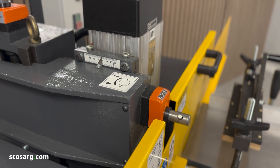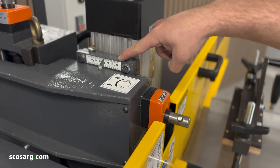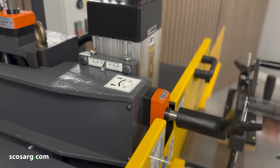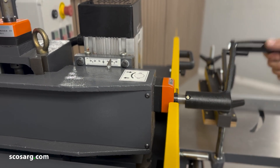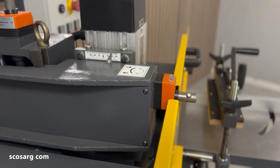At the front of the machine you can see you've got the same setup — a sticker indicating which motor is moving, a scale, and a mechanical readout. We can put the handle on this side and adjust the step to the desired size we need. We'll just set this to 20 millimeters as well, and that's all set up.